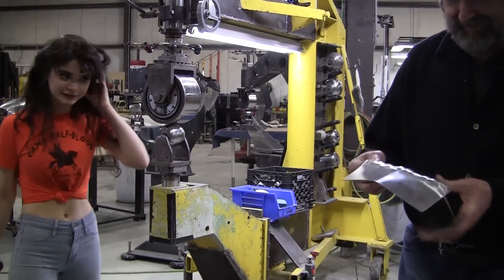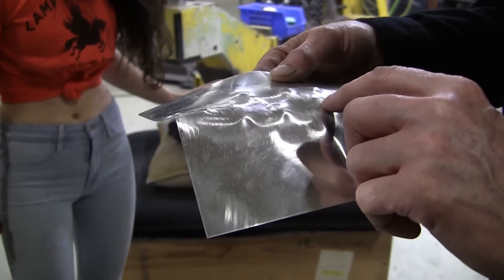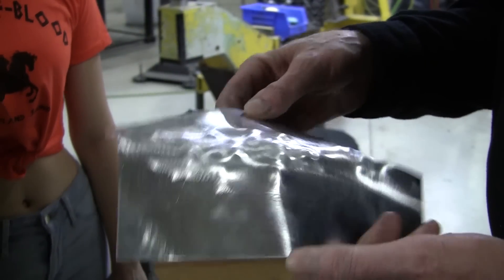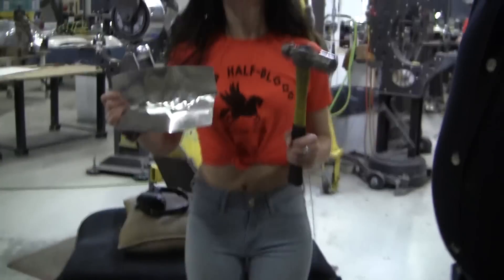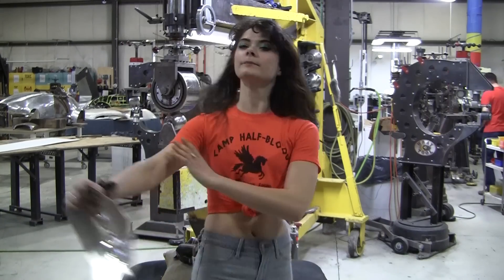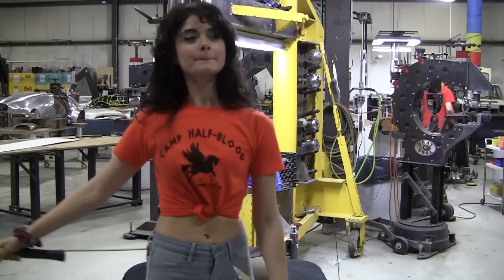Here's the Jack test — no cracks. Welded strong as the parent metal. The only evidence, which is very common, is right here where you can see the weld seam on either side — it's a couple thousandths higher than the surface right there, but no cracking. It's a perfect weld — first time Jack ever welded aluminum. That was with the argon-helium mix 50/50 with the Everlast TIG welder at 60 amps. If you watch the other videos on the Rachel Ines Pro Shaper Workshop, you're going to see the same technique — it works every time.